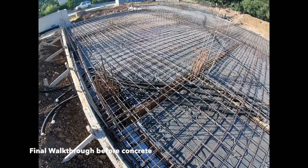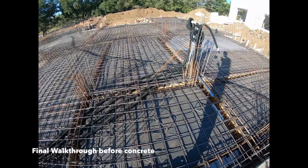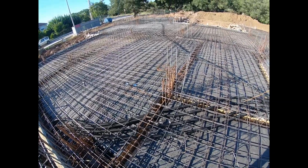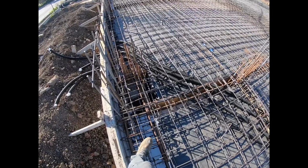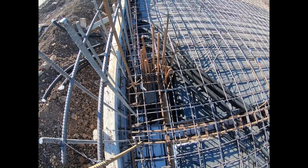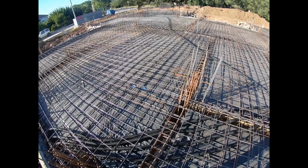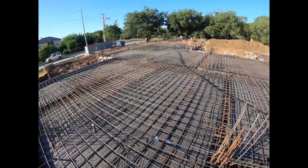We're at the build site. It's Friday, and we're gonna pour the concrete over the floor and the beams on Sunday. So I just wanted to show what went into this and how we got to this point and how a foundation is created and engineered. So the way it starts is with these piles that are driven and core drilled into the ground with a drilling rig, and the entire house essentially sits on those beams that run 12 meters into the ground, and you could kind of see wherever the rebar sticks out is where a beam is.